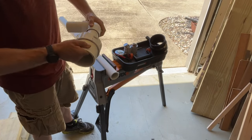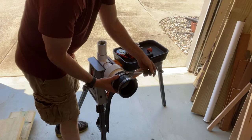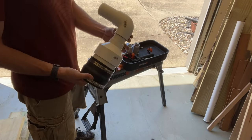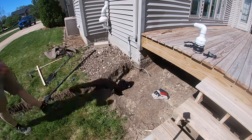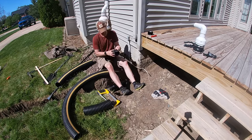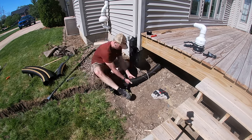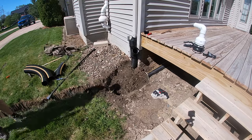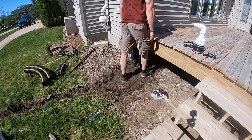Make sure you use the exact type of coupling that has a lip to hold the 4-inch corrugated pipe into the fitting — that's the finished adapter assembly. Now I'm ready to start laying out the drain pipe and connecting up all the Y-fittings. I'm connecting the outlet of the Y to the 36-foot run of corrugated and putting the downspout in place. I wrap each connection with corrugated tape — similar to electrical tape — to make sure everything is watertight. The Y going into the downspout will serve as a clean-out; I'll cap it but can stick a hose down there to flush things out if needed.